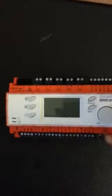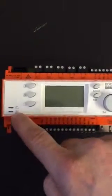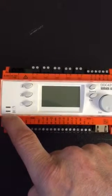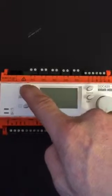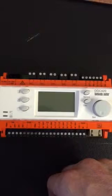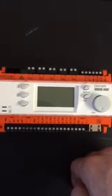Just a quick overview of the user interface. We've got three buttons on the left hand side and two LEDs — one showing for manual condition, one for malfunction messages. The information button you can press and it will display all of the controller settings, and it will also allow the user to view the current status of all the inputs and outputs.